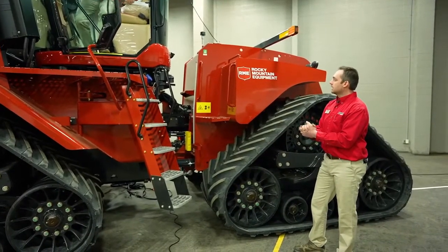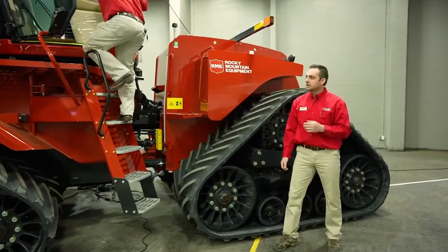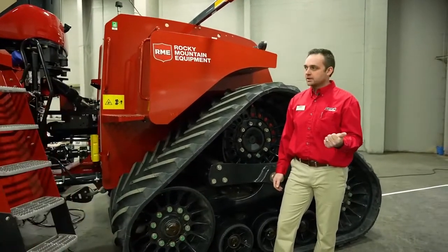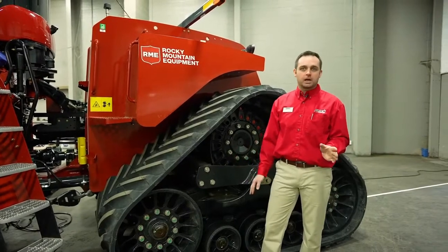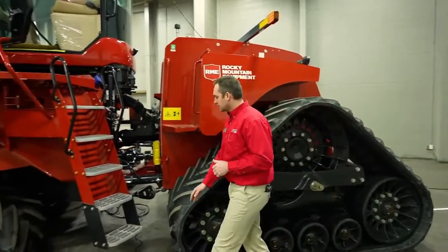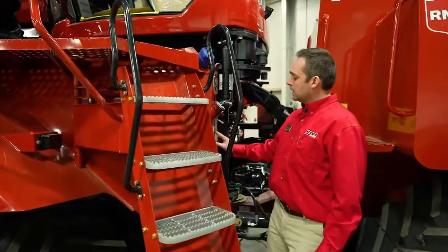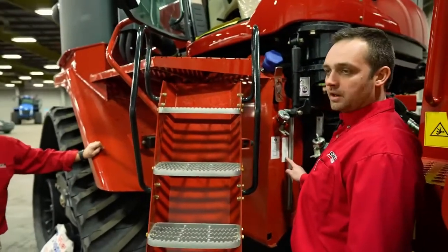You betcha. All right, it's time to reference some more service points that we have at the articulating joint of the tractor, one being our hydraulic system, as well as the transmission. These are two separate reservoirs, but we do use the same fluid, Case IH Hytran oil. On the side of the tank here, we have a sight glass that gives you your operating range. One thing to keep in mind, obviously, we need to be between these two reference points here.